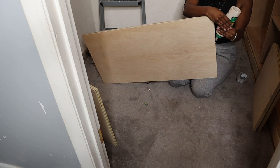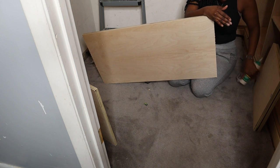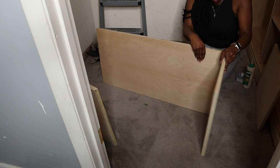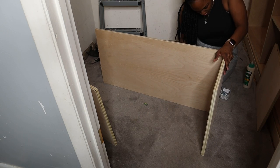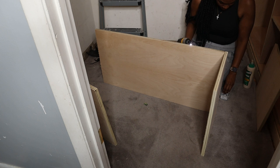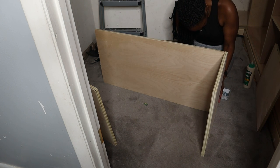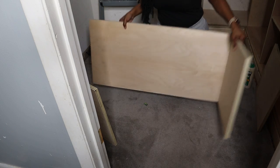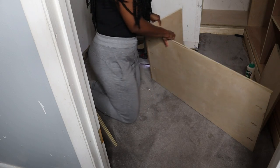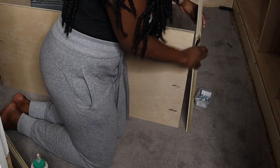I'm now building my overhead storage using a cubby system. I wanted it to be like that, so I'm going to build the boxes again the exact same way. But this one is not going to have a bottom piece — it only has three sides. For it to attach to my existing boxes, I'm just going to create pocket holes on the bottom of those also and screw them directly into my boxes that are already there so they won't move. I don't think they're going to go anywhere because it was a pretty tight fit, but just for that additional security.